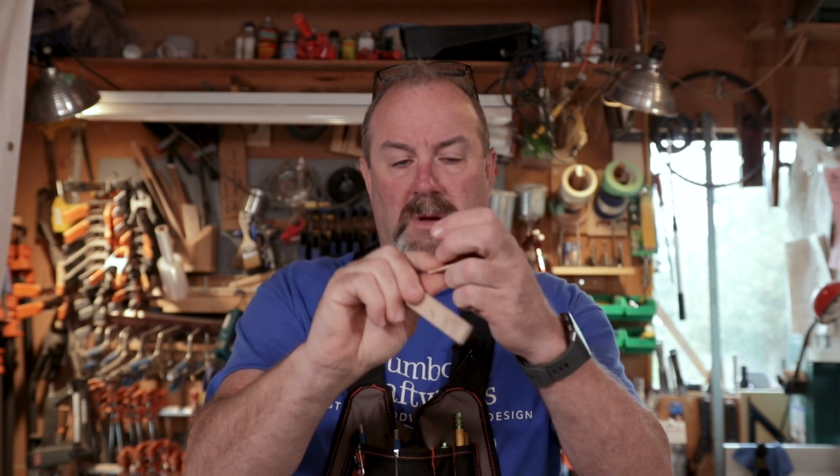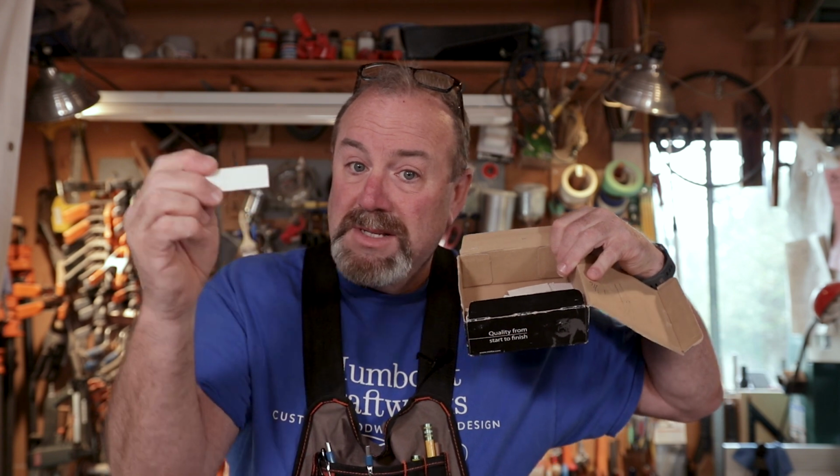All right, and then you can just pick, that's got to come up 1/8 of an inch. You pop one of these guys in there, you're good to go. I need to come up just a little bit. Well, these things are throwaways because they're just cardboard, and that's why I have so many of these. This actually came off a couple of jobs where I just used these to maneuver the wood in and out to make all the miters work, especially if you have a rake board that has mitered returns on it. And I'll show you a picture of that right here.